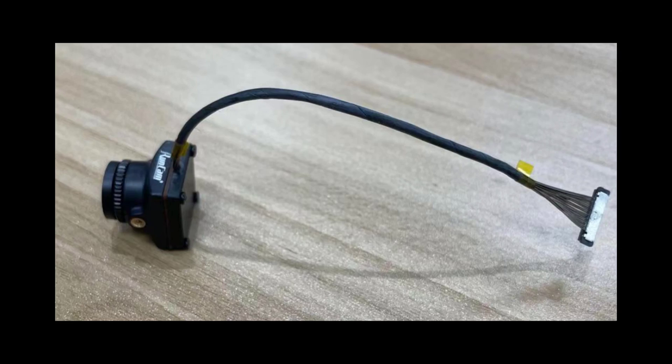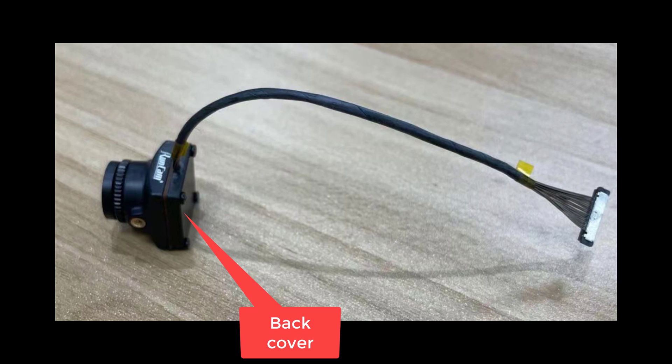I promised I'd talk about the micro camera, so let's talk about it. As everybody knows, the micro camera got delayed because of a defect in the design — I think it was an impedance out of spec on the MIPI interface, which would cause intermittent connections between the camera and the VTX. Beta units went out and we wanted to get feedback from users to make the product better. One of those things was: can we have a way to retain the MIPI connector and protect the back of the camera? As you can see in this picture, there's now a back plate on the camera to protect it from impacts and to hold down the MIPI connector. Thank you to the community for suggesting that.